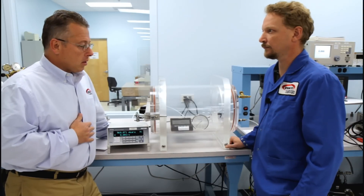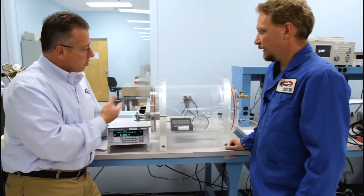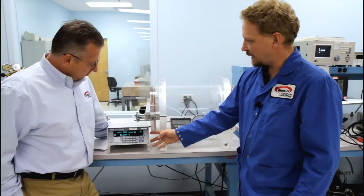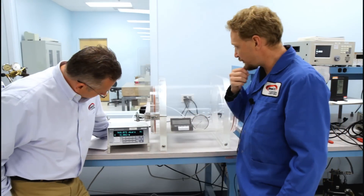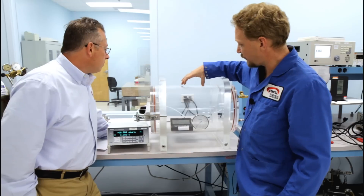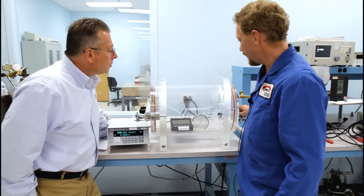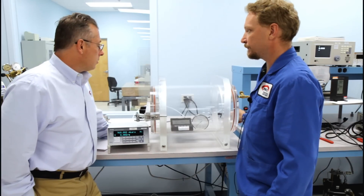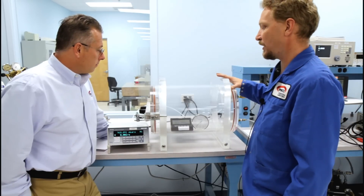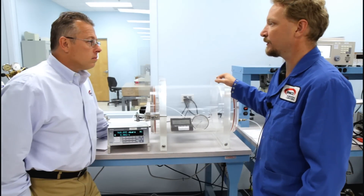Can you give us an idea of what we have here today? What do we have for our standard? What's our chamber? How is everything hooked up? We have a digital barometer that we use to monitor the pressure inside a chamber. We place the customer's unit inside the chamber, apply a vacuum or a pressure, and we can vary the environment inside the chamber and compare the customer's barometer to ours.